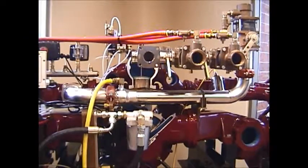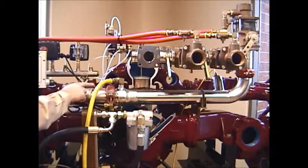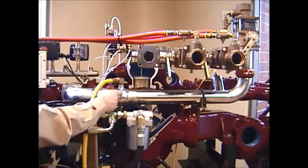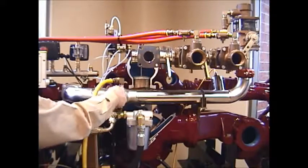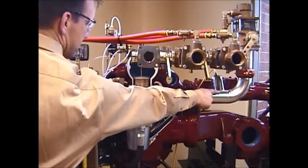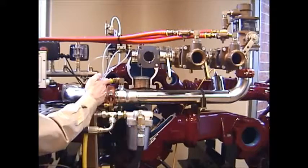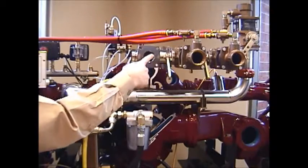Here's one of the stainless steel foam manifolds for the Darley CAF system. Shown here, the water pump discharge head supplies water into the manifold through a stainless steel spring-loaded flapper-style check valve. Through a groove victaulic, you have your foam injection fitting coming from the foam pro system. Then the water and foam solution travels through the pipe to a flow meter, where this paddle wheel flow meter sends a signal to the foam pump telling it how much foam to inject into this fitting to treat the gallons per minute of water flowing through these various discharges.